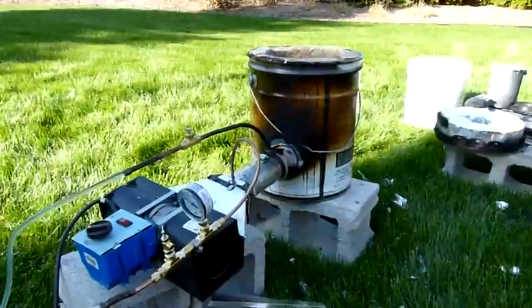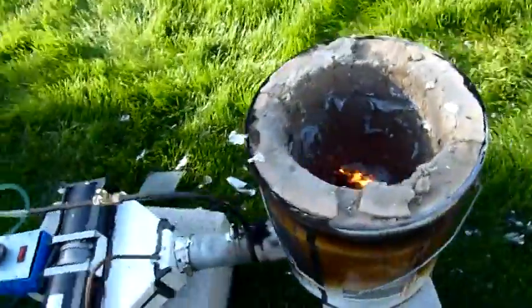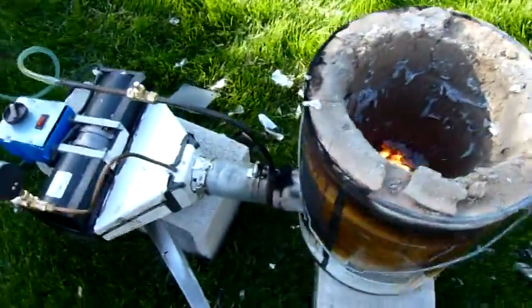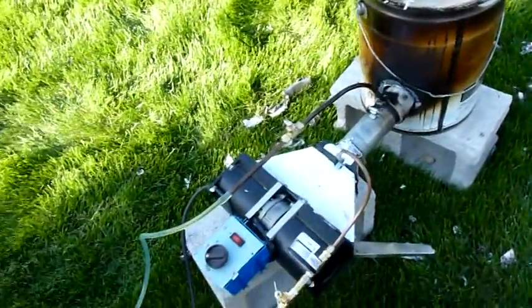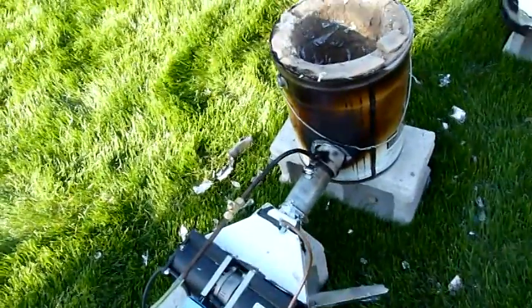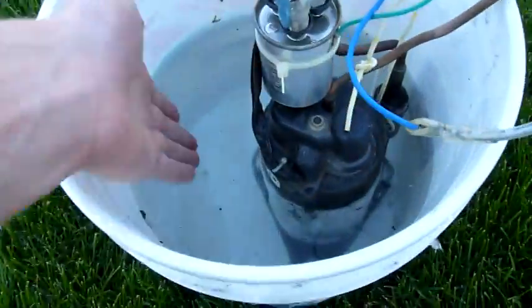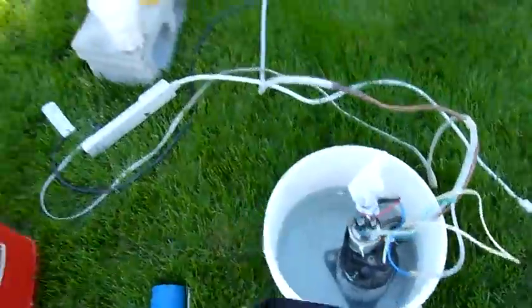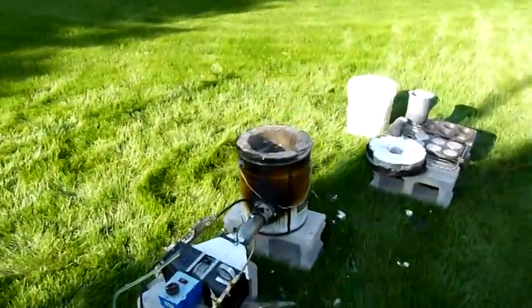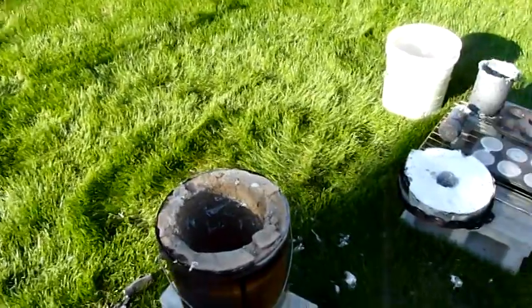So yeah. Alright, well that was the end of a successful melt. I declare my atomizer burner using the 9mm bullet a success — perfect actually. Fuel control is a little finicky, but I'm pretty sure it's because of the crap on the fuel, and that can be fixed easily. Pressure's still running, didn't really get hot at all because I got the water in there and that worked out perfectly. So yeah, that's a successful foundry run for me. This was another Doug's Lab video — thanks for watching, subscribe, rate, and comment.